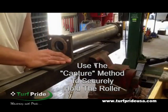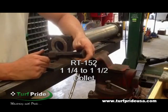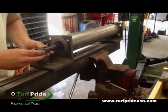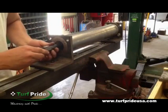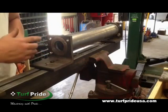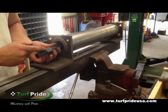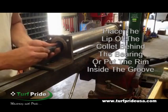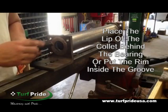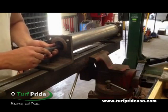This is the capture method. Use RT152, the one and a quarter to one and a half collet. Note that if the bearing shield is still intact, it may keep the collet from going all the way in. You can either remove it or just tap the collet right on past it — it's not going to provide much resistance. Place the lip of the collet behind the bearing. You can also put the rim inside the groove in the race, but in this case it went behind the bearing.